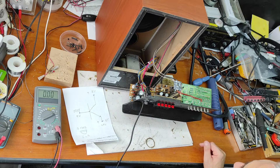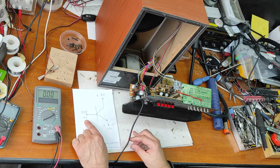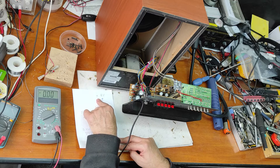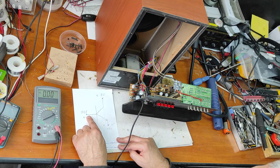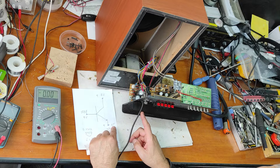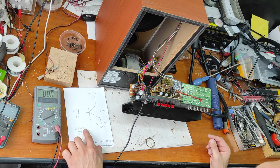To solve this I found the simplest solution. We have this 5 volt input signal — it's 5 volts when powered on and 0 volts when powered off. I'll use an 8 volt power supply for the module, so the module is powered only when the speaker is on and off when it's not. To switch it, you can use any NPN transistor — I use a D1302.